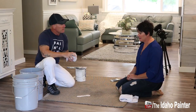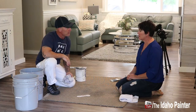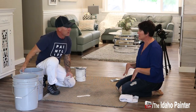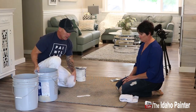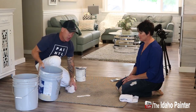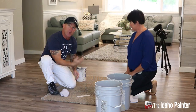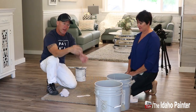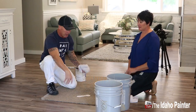Lisa, you've got a rag there. In the past I would have panicked — I usually walk into a room that's being painted and get covered in paint. Now I'm in my nice clothes and I'm not going to panic. What we don't want to do is leave this on here a long time because it's going to keep soaking down into the carpet, through the backing and into the padding. We've got our two buckets of clean water — one bucket to pick up the bulk of the paint, and one bucket to wring your dirty rag out so it's cleaner, and then begin picking up the paint.